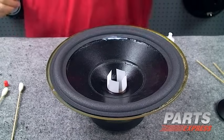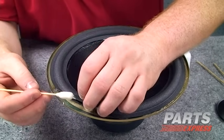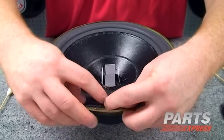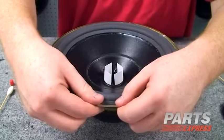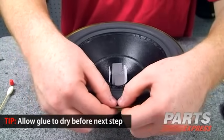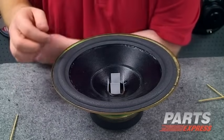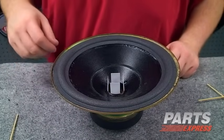Now that we've got that brush fire put out, let's go ahead and apply glue to the other edge of the foam surround. We're just going to lift it up and apply that same fairly conservative, even layer of glue. Now we've got glue applied to the entire underside of that edge. We're just going to go ahead and squeeze it down with our thumbs and make sure that it's going to adhere all the way around. Be careful around the screw holes and make sure that you're going to get a good airtight seal, because the basket is going to have a lot less area here for that glue to adhere to. For the first ten minutes or so we let the glue dry on the outside edge, tamped down anywhere it was raising up, added a little bit of glue wherever it was necessary, and now everything seems to be adhering to the cone and the frame.